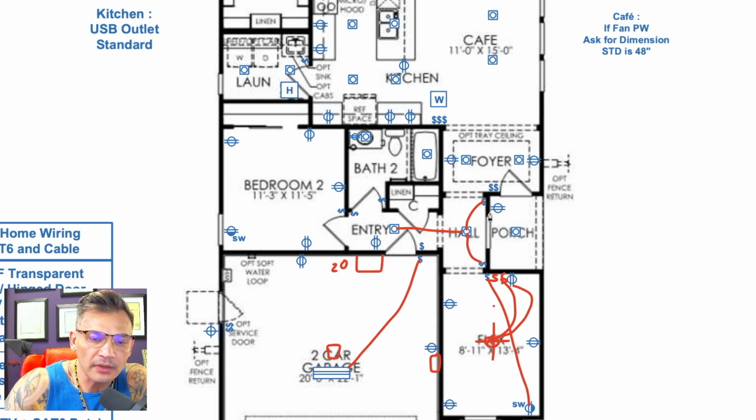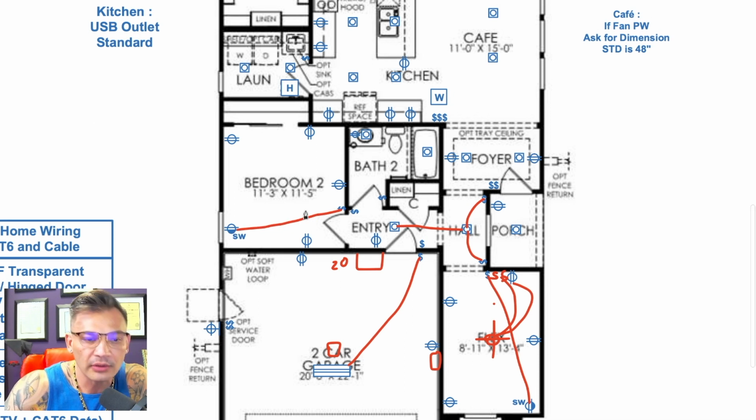Now, this section is good. Let's walk into this bedroom here. So, bedroom, we have an outlet here, outlet here again, another outlet here. Then we have, again, our half hot, which is our lamp light. That's controlled by this switch here as you enter, okay? I always talk about having 4-can lighting, but again, if you are on a budget, okay, you're just going to do the pre-wire ceiling fan.